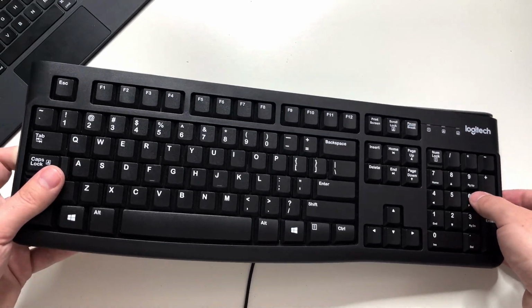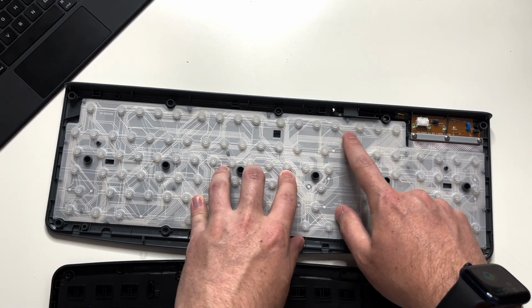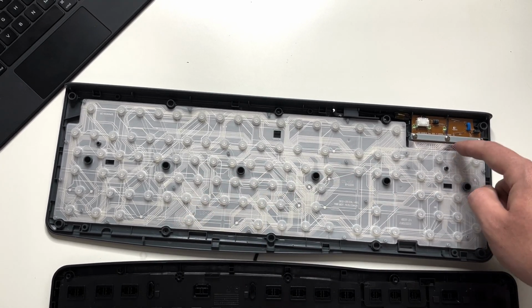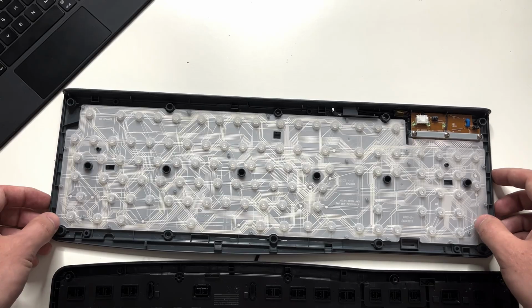For some quick understanding on the way that a keyboard works, there's essentially a grid of wires underneath your keyboard that each key is connected to 2 of those wires. Each key has its own unique pair that when actually pressed, a signal will be sent among both of those wires, and then your computer actually converts that signal of those 2 wires being sent into an actual key itself. What we have right now are those raw signals coming from those wires, but we don't actually have the conversion methodology to get back to the letters of the alphabet. And so what we need to do is program the Teensy to convert those wires into normal keystrokes.